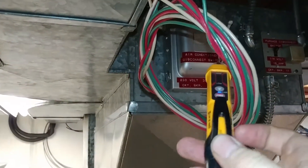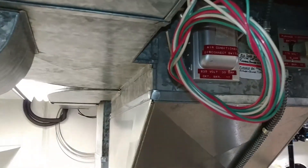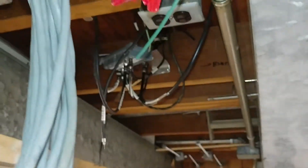My main ground lead is run to the plumbing here and then runs up and eventually makes its way up into the attic. There's a bunch of stuff in the way right now. I've got this right here, which I killed the power to — this was live when we moved into the house. This open box in here is still live. I don't know what he was using it for; I was told it was a mini air compressor of some kind, and this was its direct feed. I did disconnect the wiring — that's the wiring right here that's not connected. That's where I cut it off; the red and the white wire is also in there.